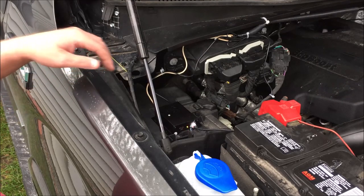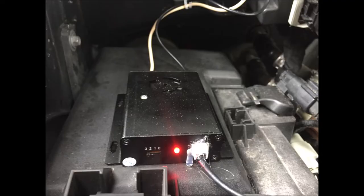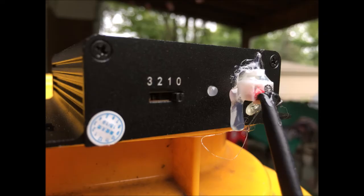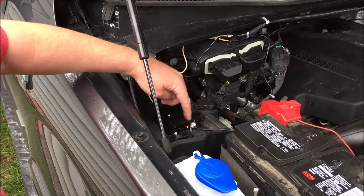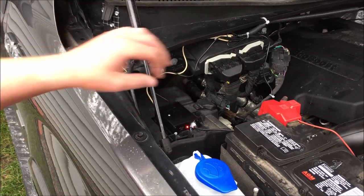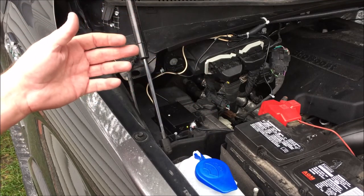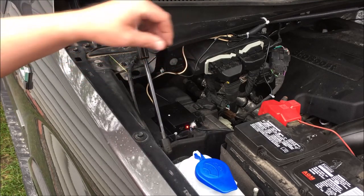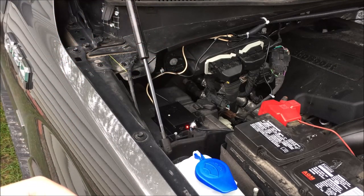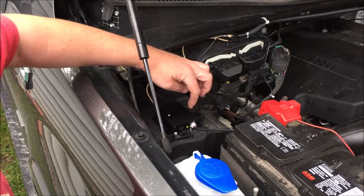Down in here — I'll take a close-up and show you — I used a hot glue gun to hot glue this connector. I was having issues with the wire wiggling and then it would stop working. It wouldn't go back into normal flashing, so I knew it had disconnected. I'd wiggle the connector and it would start working again. So I'm going to order another unit and replace this whole part and the wiring harness.